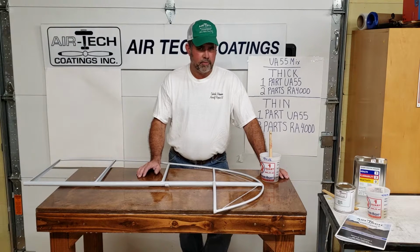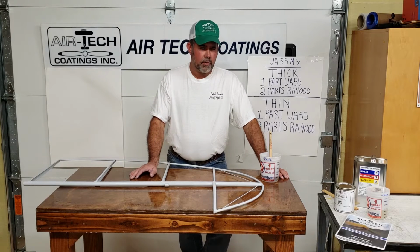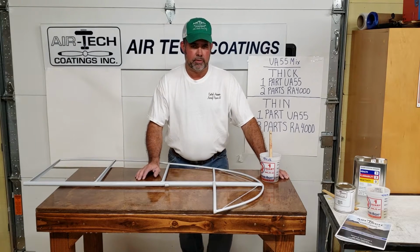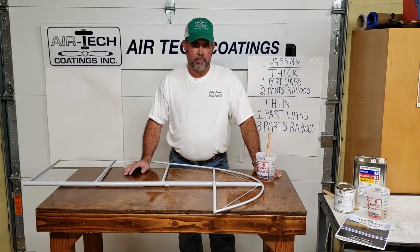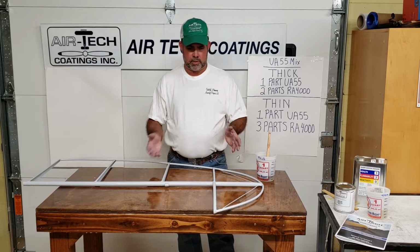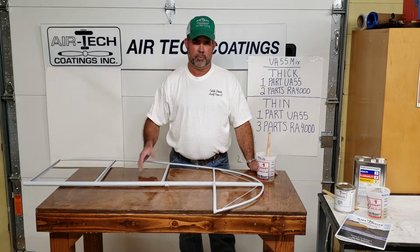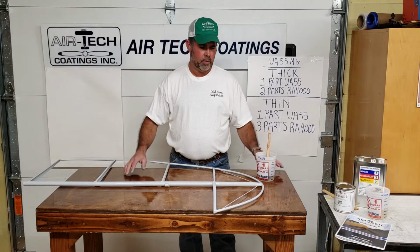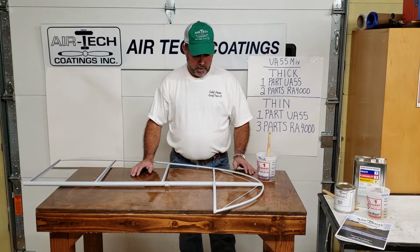If you're a mechanic doing a certified airplane, we have an STC for just about, I think, it's very rare that I come across one that someone calls in and it's probably a 1920 something that they only got 2 of them flying now. So we usually can work around that. But if you're doing a certified plane, refer to your 4313 on your overlaps and what's legal. We're going to cover all of that through these various videos, doing wings, fuselage, putting on primer, doing double cover, doing solid covered wings that are solid wood. We're going to try to do a video covering some form of that all the way through.